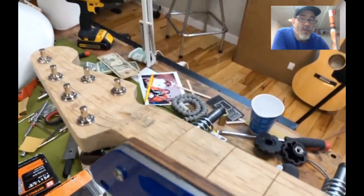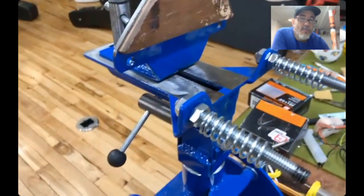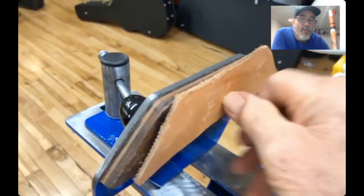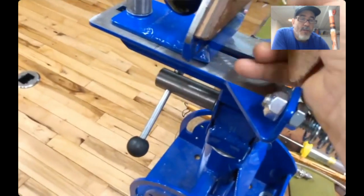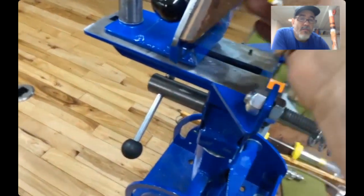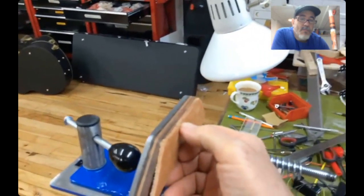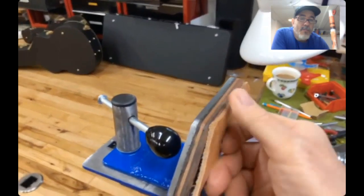Are you going to take metal off or just the wood? This is a stack of plywood and I took the leather off — it peeled off very easily while I was talking to Jeff Howard. He glues it down with super glue and I think this rough surface of the leather doesn't grip as well as a smooth surface. Once it's worn in — well you put some urethane on there like on the StewMac vice. My only complaint with urethane is on newer guitars it can bond to the lacquer and pull lacquer off.